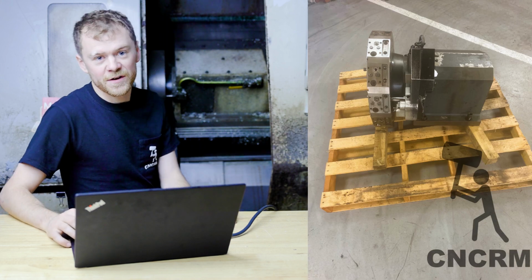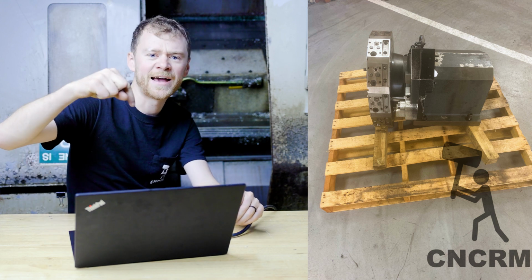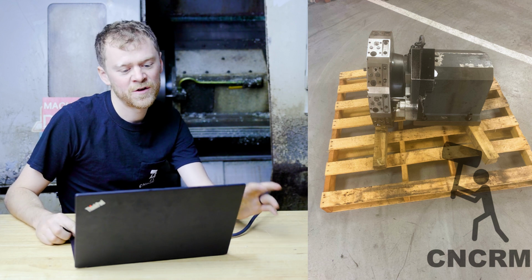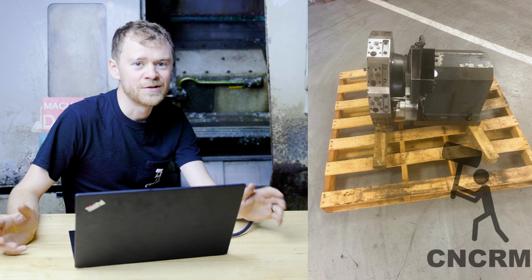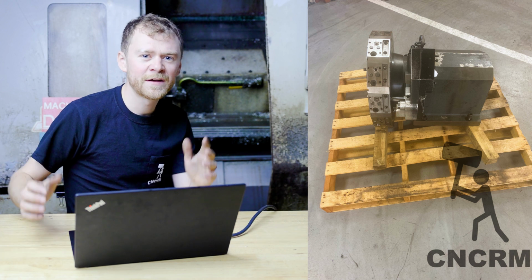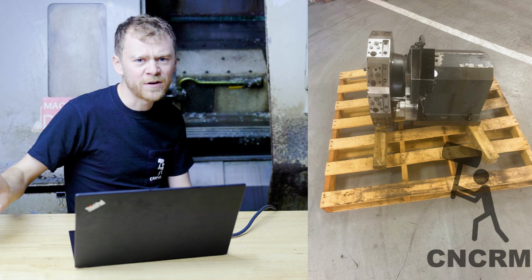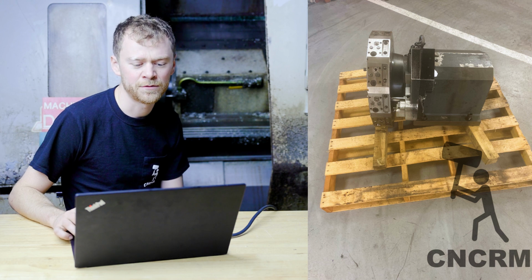Took the turret off. That's not that big of a deal. Put an eye bolt in the top and it picks up nicely. You're going to have to disable the parameters for the turret motor so that it's not looking for the home switches or the motor. The tricky part is, once you do that, you've then got to home everything. I disconnect it while the power's on, then home everything and try not to turn the machine off again so you aren't stuck jogging with setting 53.